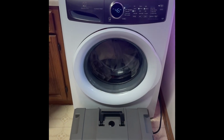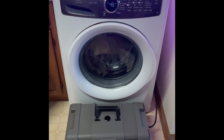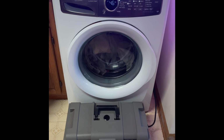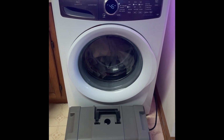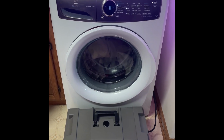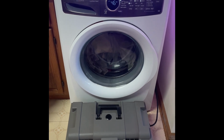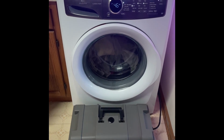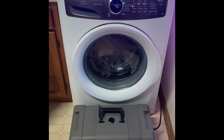So before we do include this video, I thought I would try to test this. I plugged it into my TV, it works fine. That only pulls 100 watts. Plugged the PlayStation into it, which pulled about 100 watts as well. So it's pulling 200 watts, which is easy for a 600 watt inverter. Plugged it into my box freezer. Worked perfectly fine when the motor stepped up.